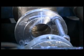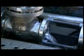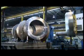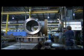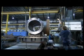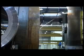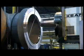Many gate valves use hand wheels to control the flow — turning this wheel opens or closes a gate or wedge inside the valve body. This giant ten-ton gate valve works the same way. It will receive an internal gate or wedge that starts and stops the flow of liquids or gases. First, an automated horizontal boring mill prepares the valve body for assembly and for a controlling mechanism — it takes a motor, not a hand wheel, to open and close a wedge that weighs about fifteen hundred kilograms.